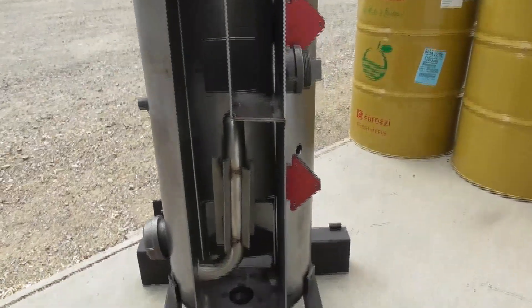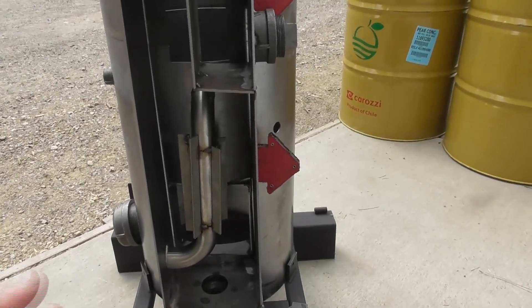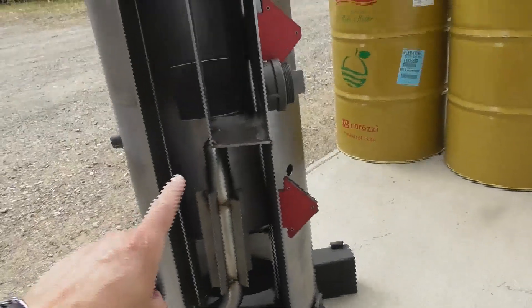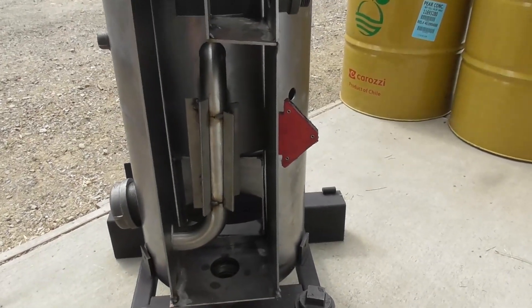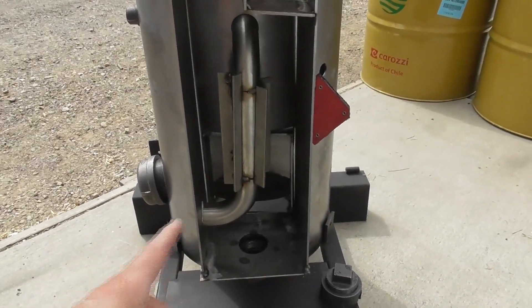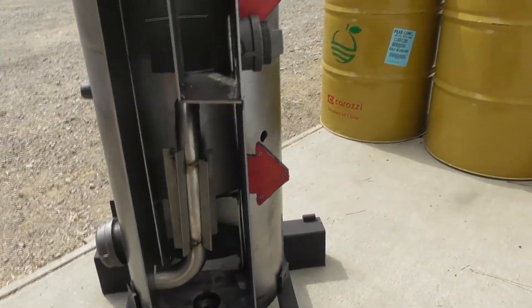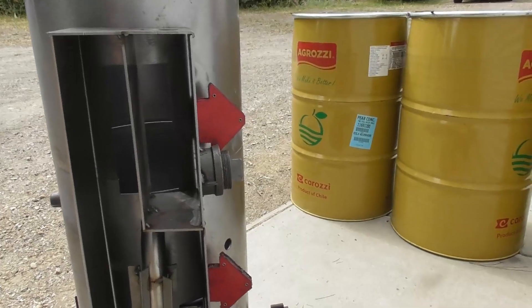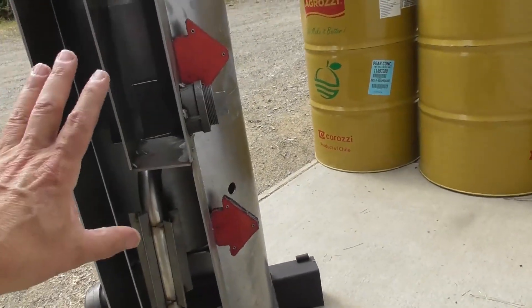It's a little bit tricky to build because you have to weld the air intake first before you can put the box in. What you want to do is dry fit the parts so you know where the air intake has to be and the outlet on the front. You're going to tack it, take the box parts off, do a full weld around your air intake, and then start building the box piece by piece. You start with the bottom with the clean-out on it, then put the front and weld where the air intake meets it, then build up the divider plate, the top pieces, and the bottom side panel. The very last piece is the upper side panel, which you weld from this side to make sure the box is completely sealed. You don't want the gas mixing inside the box — you want it to flow up around the pyrolysis and then out. Then put on the back plate from there.